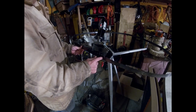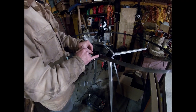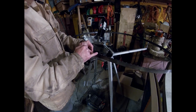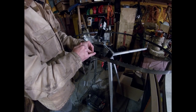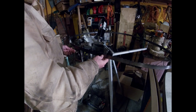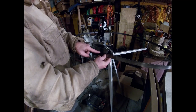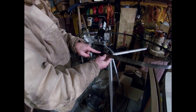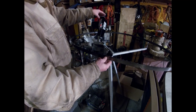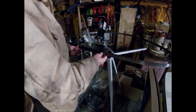They say that the weld can make the distance between teeth different from one gap to the next. I've never had one yet that was different from Woodmiser, and I hope I never do. But every time it sharpens near the weld, I make sure I'm watching so that if it's sharpening too much or too little, I can go back and get it. I'm ready to lift it if it's going to take off too much — it hasn't yet. We'll see on this one.